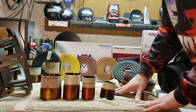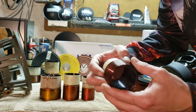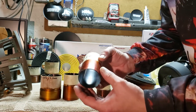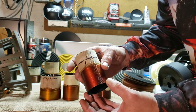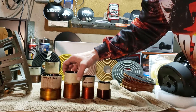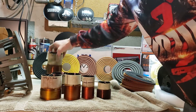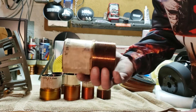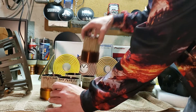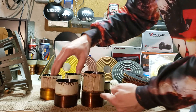Here are two coils to compare. This one has a lot of layers - it's an eight-layer copper coil and it's very heavy. This one is a four-layer flat wound aluminum coil and it's extremely light. I also have some flat wound long aluminum coils and some round wire copper here. This round wire aluminum coil is also very light. This copper coil weighs about double what the aluminum coil does.